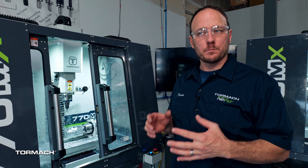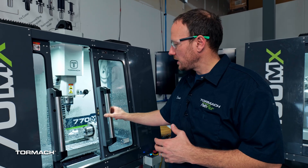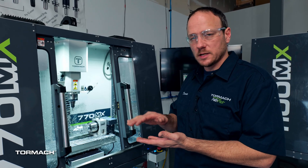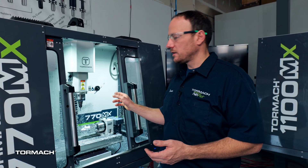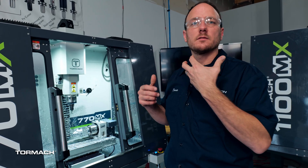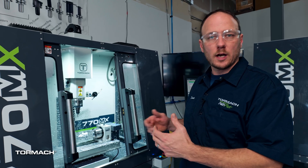As part of the planning on this job, I deliberately broke up bulks of tool paths into different files so that I could check progress as we go along. We've done the first three and a half inches or so of roughing, but only to a certain depth because the tool doesn't stick out of the tool holder deep enough to do all of it at once. I've got the next file queued up to do that first inch and a half around his head, face, and beard area with the same tool, but with the tool path constrained down to that first bit so we don't have any collisions.